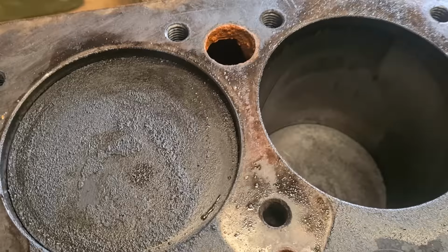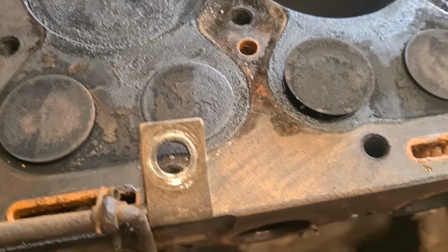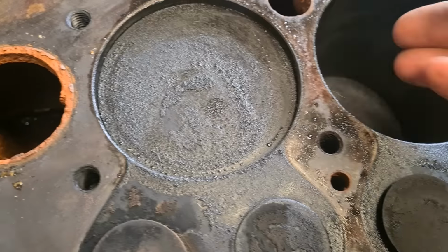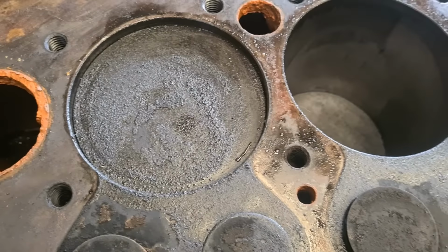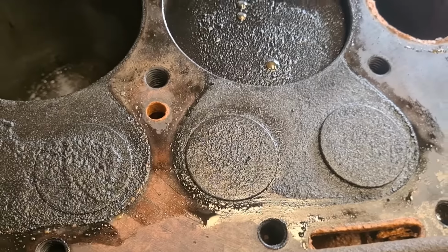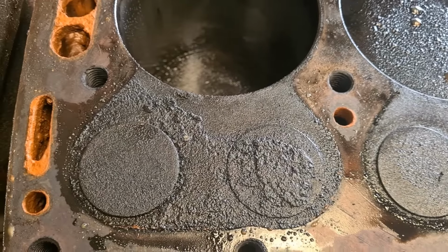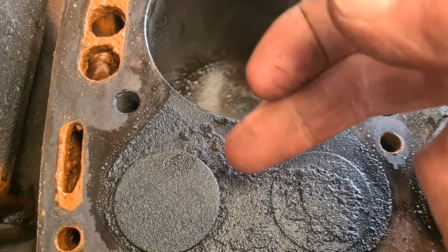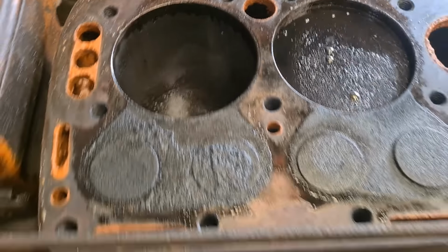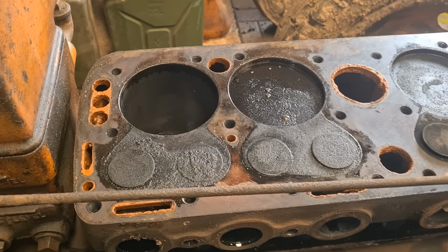I mean the front 2, you know, is pretty much what you'd expect to see. Valves are clean and burning clean. Cylinders are, you know, just slight oil, which they need, but basically reasonably dry burning style pistons. And the back valves, like I say, you can see they're getting well clogged up, and a lot of build up of carbon and obviously lots of oil. So that's indicating that either all rings are broke, or they're just stuck in the pistons.